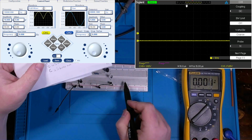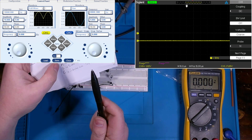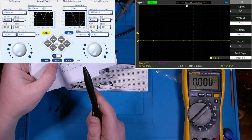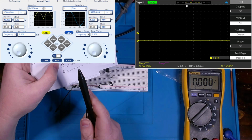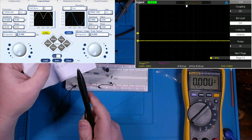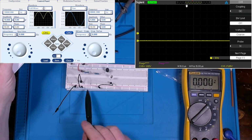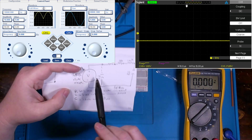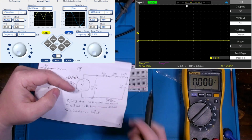Now, on to our circuit in this demonstration. Essentially, I've taken my signal generator, or arbitrary waveform generator, to produce a 10 kHz signal at 10 volts peak to peak, and I set it up to represent a full wave, because it's going to act as a full wave bridge rectifier. This circuit down here is what we're going to use to get ripple off of our rectified voltage.